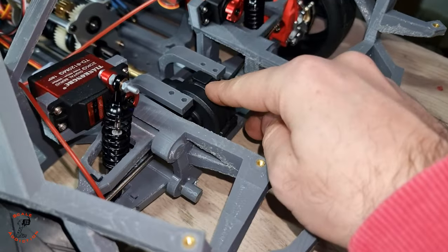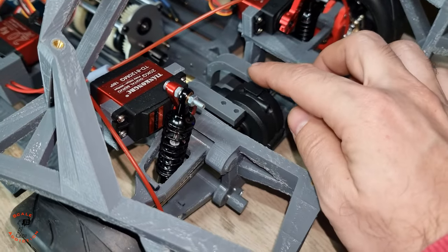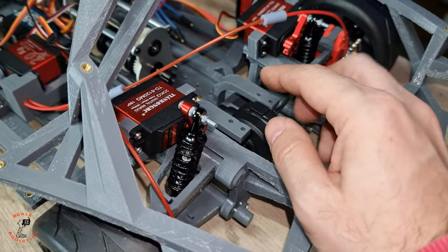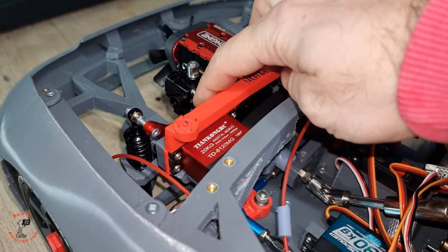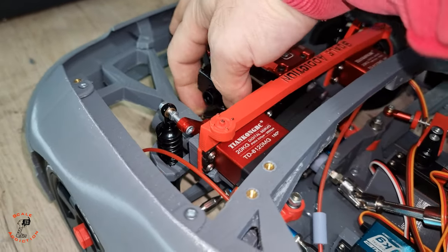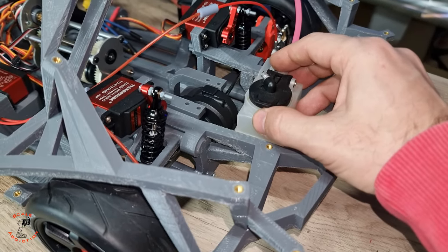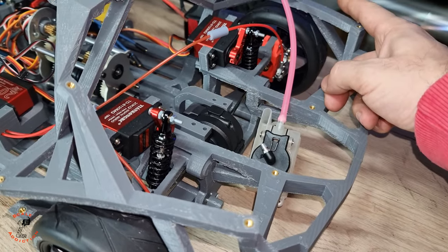For the next video, I will bolt down the differential and make the dog bone. I will keep it standard so you can purchase it on AliExpress or Amazon. I think it has to be around 33 millimeters, but we will see. And the next thing I need for the gas, I have to figure out where to put a small servo for the throttle for the engine. And for the gas tank, I think I have to put it here. It's the best place for this, and it's more realistic, and it will go here to the gas door.